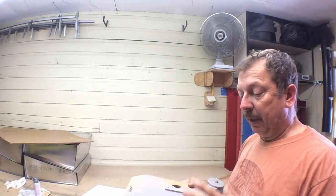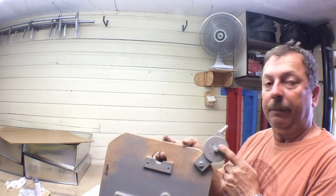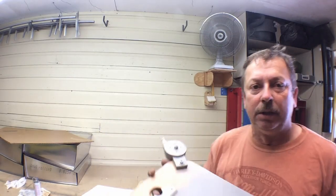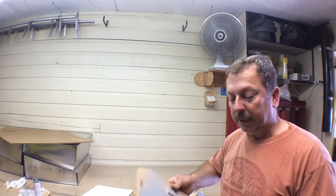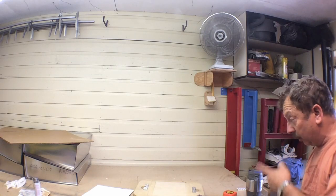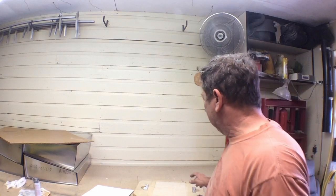You go ahead and ram up the upper section, and then when you disassemble them, we've got an air vibrator on here, and these are cast vibrators. I've got a match plate set up for these two. So when you add air to them, it spins a ball bearing in them, causes vibration, and you can lift first the top half of the mold off and then the bottom half off, and they index up fairly nicely. So if this pattern is one that I like, I will adapt it to a match plate so that I can cast more of them.